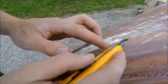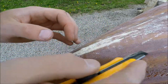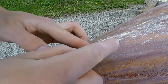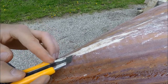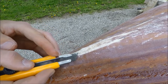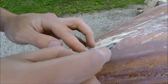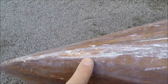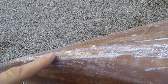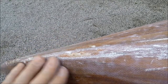The more I got thinking about this, the more I realized this area right here is pretty bad — all the fiberglass cloth is coming up. What I'm going to do is cut this out and replace it since I'm doing all this work anyway. There it is — see that? Completely delaminated. There's maybe one or two layers of cloth on there; the delaminated stuff just comes out pretty easily. I actually got down to bare wood here. I'll make a small cloth to fit in there and then put a big one to go over the whole thing to reinforce it, then put the epoxy on.